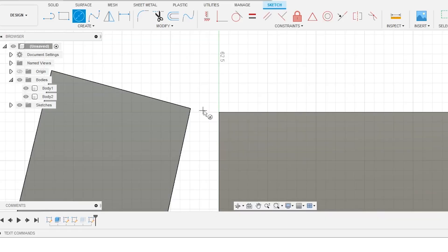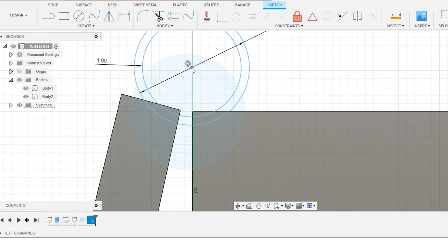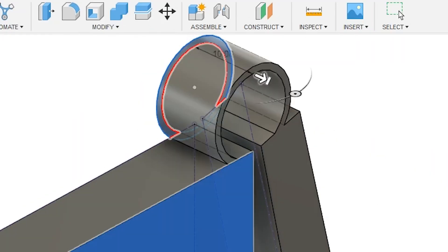You can reduce the wear on a particular living hinge just by giving it more material to wear on. In the case of this circular hinge, all you're doing is giving that stress more places to go by giving it a much larger area to work on. Rather than a very small defined point, you have it spread over a very big, broad area.